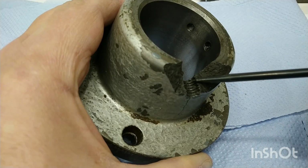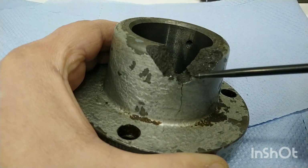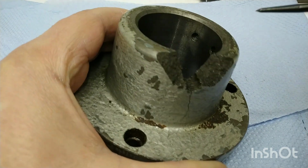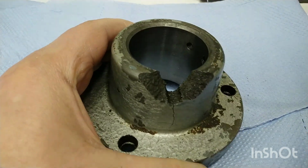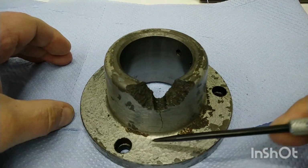5.5 millimeters is the nearest metric tapping drill size. It's 7/32 I think for a quarter 28. So that's what we're going to do. So without further ado, we'll get over to the mill drill now and we'll start preparing to put these holes in.